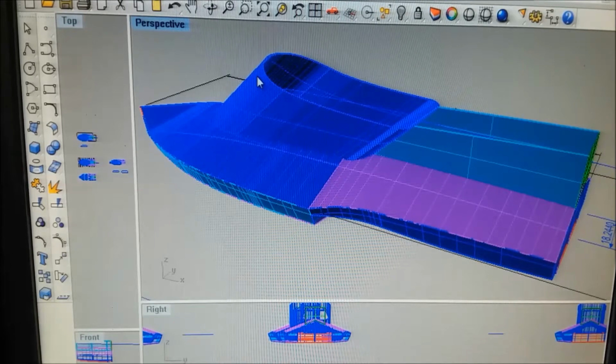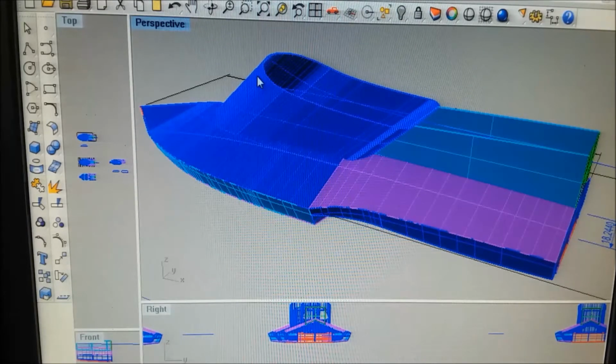Well, we're doing a little continuing on the lockdown boat designing. This one we call a tunnel boat. It's because it's got an air channel down underneath the bottom of the boat that takes a lot of the weight off of the boat and cuts hydrodynamic drag. Open class hydroplanes are generally built on this similar plan, except that the side pods go farther back and it rides on the tail end of the side pods.